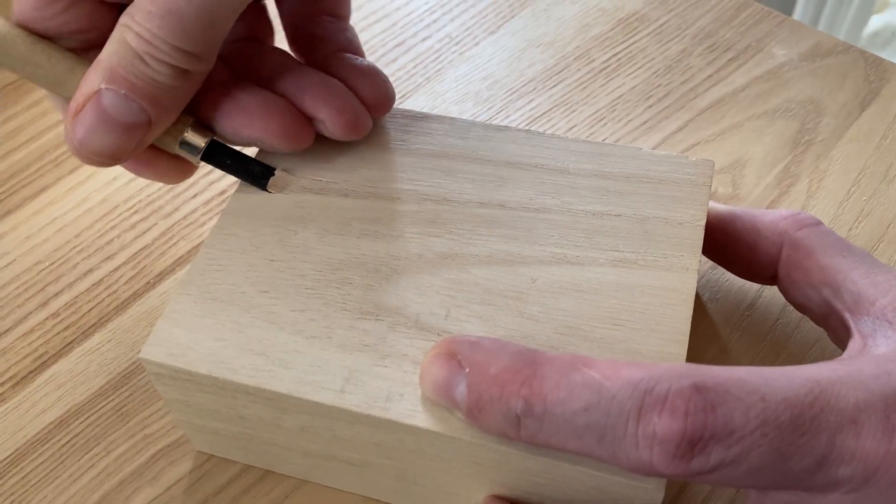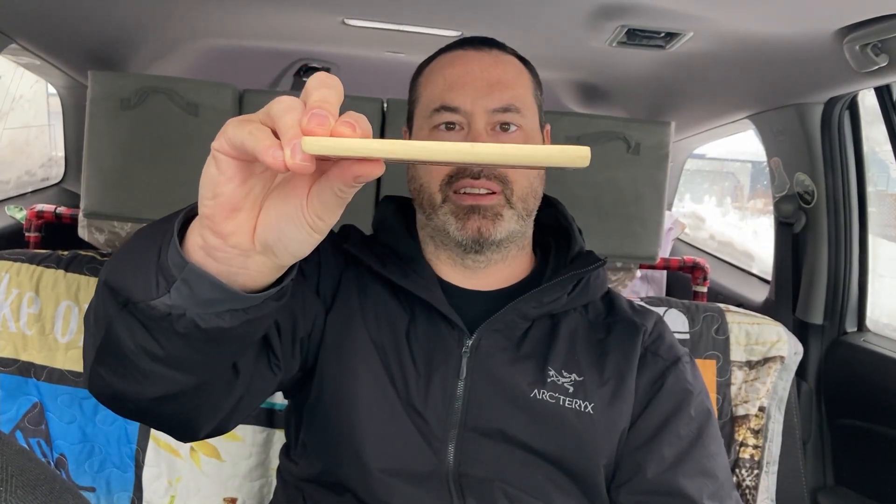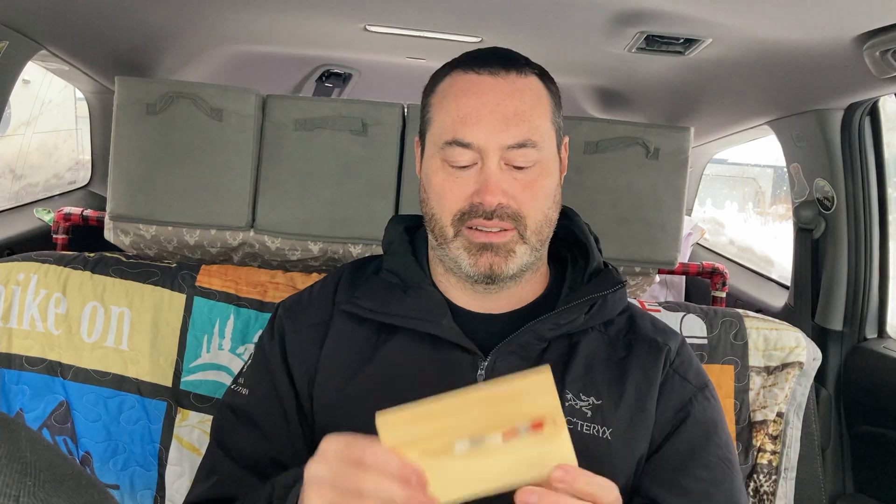Then I needed to figure out how to store them on the back. I thought about using the router to cut a strip in the back, but in the end I decided to just use chisels. I chiseled out a channel in the back of the board to the right depth so you can't quite see the pieces when they're attached to the magnets — they're pretty level, and if they stick out a little you just roll them and they get hidden away. Then I drilled two holes for the magnets. I couldn't find the right-size drill bit, so I used a different one and worried about drilling too deep and getting holes through the front. I ended up drilling a small amount and chiseling out the rest, then stuck the magnets in using epoxy glue, let it cure overnight, and everything was done.